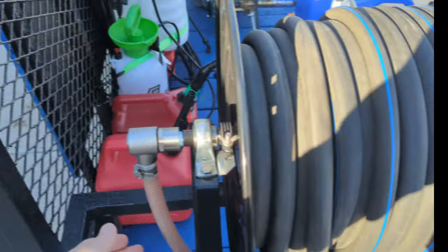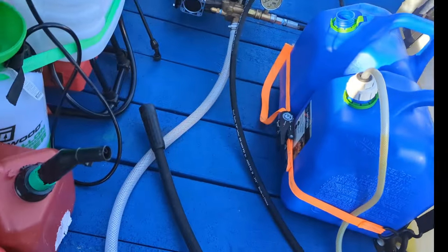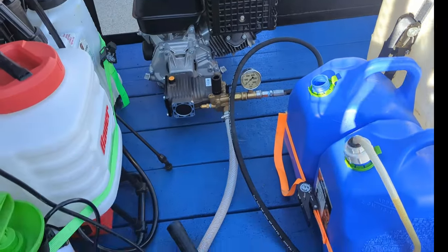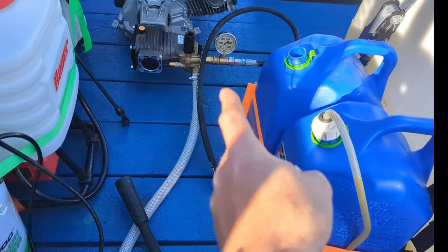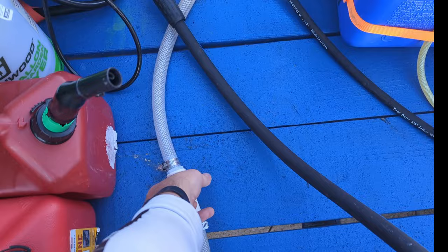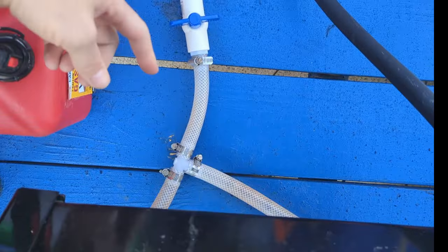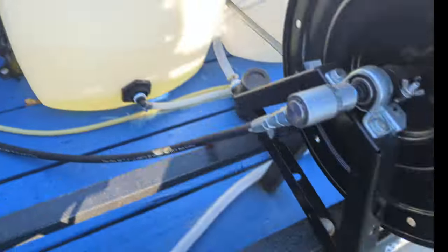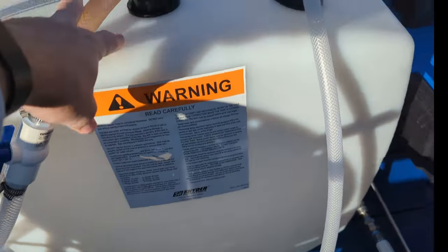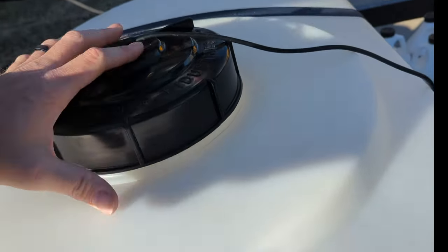The plumbing is pretty simple. I got some hose barbs, stainless steel clamps — everything goes straight down from here straight to the pressure washer. I do want to get a filter for that line; there's a screen on it but I clean it out all the time. I open this valve and water goes straight to the pressure washer. If I want to fill up the tank I close this valve, water redirects to the right, goes all the way down through a filter, and goes right into the tank, which has a Hudson float valve inside to prevent overfilling.